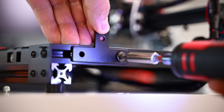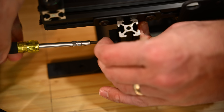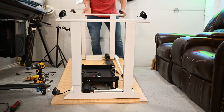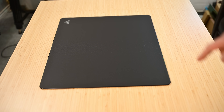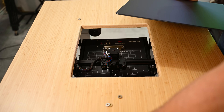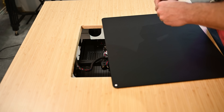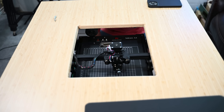Then we can position it perfectly. That's pretty nice right there, and that is on there, baby. Here's my mouse pad - it's just a mouse pad coming down. I needed the parts of the mouse pad that are touching to slide freely, so I first tried thrust bearings - but there's still quite a bit of drag, not quite as flowy as I hoped. It turned out mouse skates were way more efficient - way better than the thrust bearings, which I wouldn't have expected. I spent a good long while making sure everything was perfectly level.